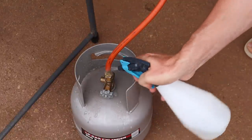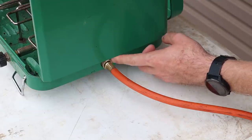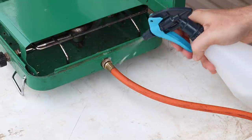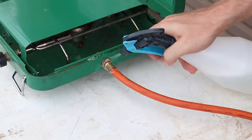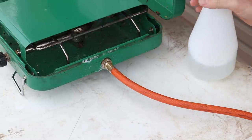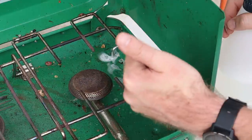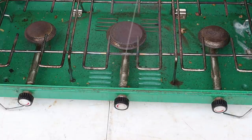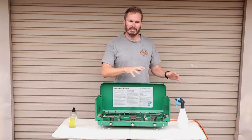We're obviously looking for bubbles. Looks good down here. Now we move to the threaded fitting on the stove — I'll just pop this windshield down. Make sure you get this side and the other side as well. You can also have a bit of a listen. I haven't heard any hissing, I see no bubbles — also all good. And it's not going to hurt to get in around the knobs and in the back where the burner tubes connect either. So hopefully you've got no gas leaks. If you do, just take note of where they were.